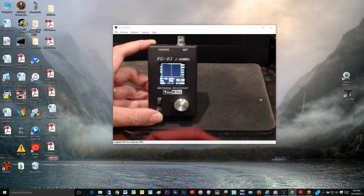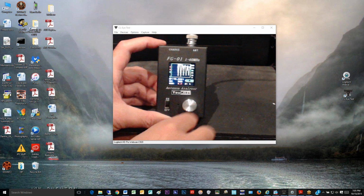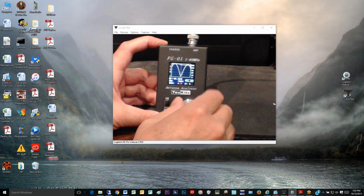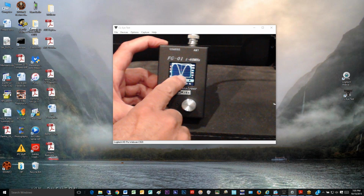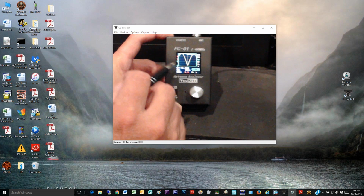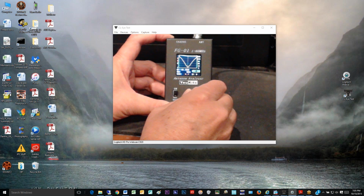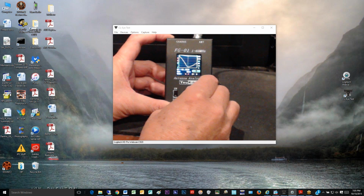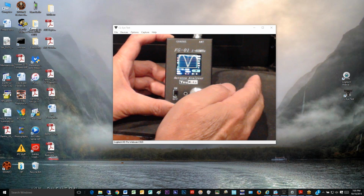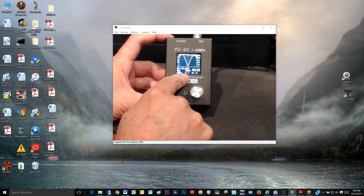I have an antenna here. Let's see if I can pull it out without destroying it. So I just hook up my antenna here to this guy. And you can see as soon as I do that, I get a chart. And then what I can do is I can measure, and this is SWR, standing wave ratio, and impedance. And wherever it is at its lowest, it tells me where the antenna is resonant. It's hard to read. It's impossible to read for you guys. You have to take my word for it. But right now, this antenna is resonant on 10.360 megahertz. And as I start to move to different frequencies, it shows me where I am. And that's how I can tell if I should lengthen or shorten my antenna or adjust my feed line or something else. Okay? And it measures SWR here and impedance here.